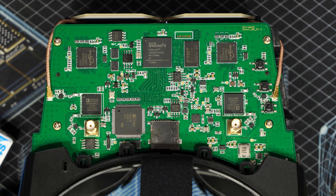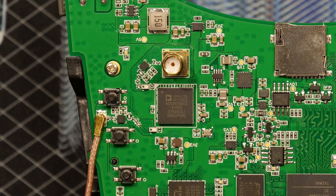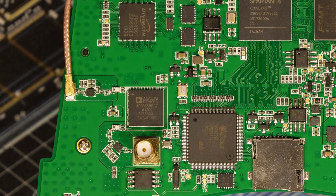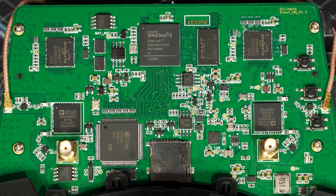Taking a closer look at the main PCB, you can see the custom ASICs from DiviMath — the DM5680Ts — which are the main chipset of the HDZero digital FPV system handling encoding and decoding. There is a Spartan 6 FPGA as well as two Analog Devices transceivers handling the RF side for the antennas and main RF reception. There's also what appears to be a microcontroller from Star next to the micro SD card slot, which may be handling firmware or the onboard recording. Overall the internal electronics appear well made with nothing of concern.